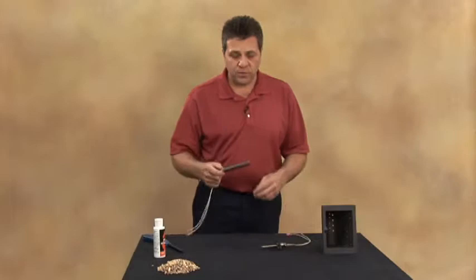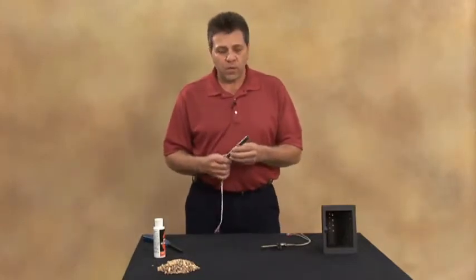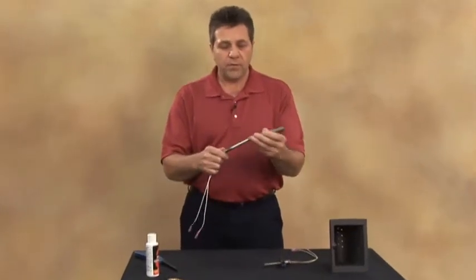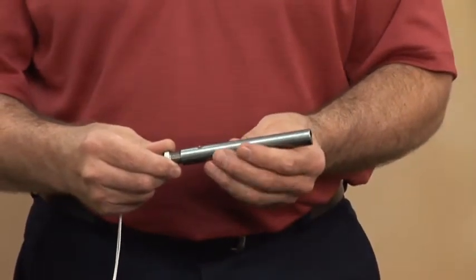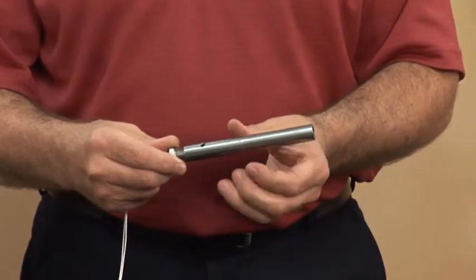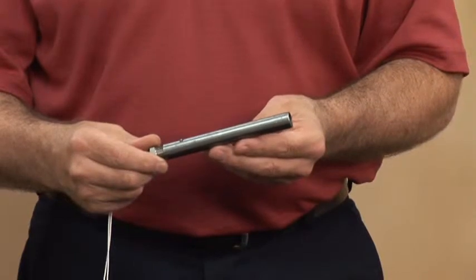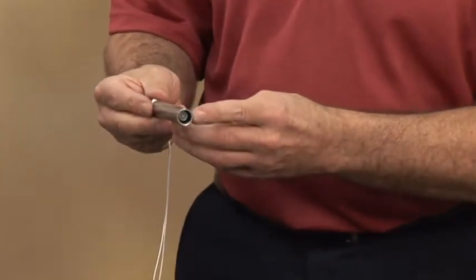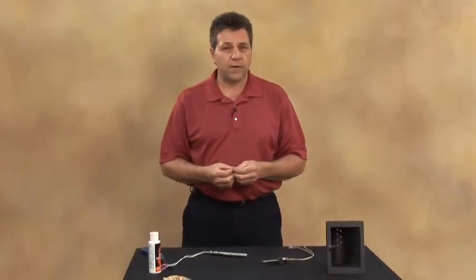To talk just a little bit about the ignition system — there is no flame with the auto igniter. The cartridge located inside of the ignition tube is a hot element that heats up super-red-hot and distributes heat down through the tube in the form of superheated air, which goes down into the fire pot at the base of the unit, and that's what heats the fuel up to the kindling temperature. Wood pellets will ignite between 300 and 400 degrees Fahrenheit, and corn needs somewhere between 700 and 800 degrees Fahrenheit.